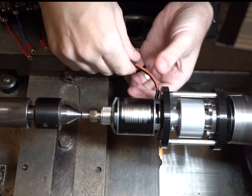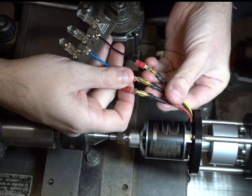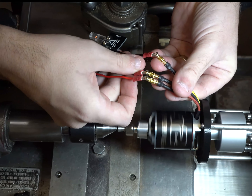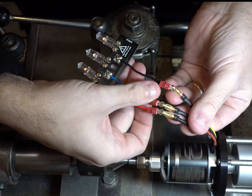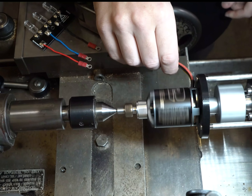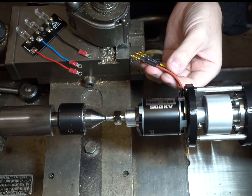There's not many eddy currents. And what I can then do is I'm generating just on one phase, and if I connect all three up carefully — there we go, we've got all three bulbs lit up. Now obviously they will be a lot brighter when it spins faster. At the moment we're only doing about 1600 RPM. But once the turbine's running, which will be running a lot faster than 1600 RPM, this will be much higher voltage and we can turn that voltage into DC when we want to.